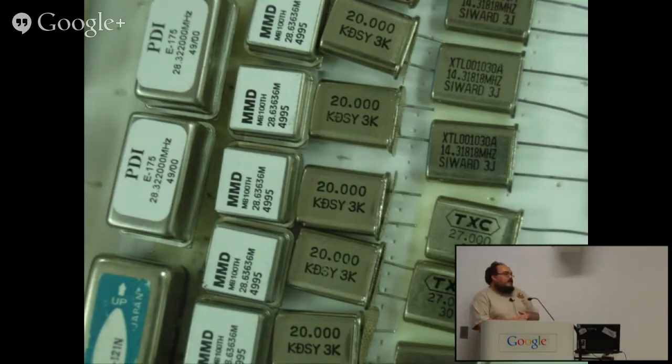So yeah, the next step to make these oscillators more accurate is to first add a temperature sensor, and by using previous measurements, compensate for the drift of the oscillator from temperature by what we think is happening. The next step above that is adding an oven and keeping it at a solid temperature, so you get more consistency. There's also voltage control, where you control the supply voltages, again in an aim to be more consistent to what you give the oscillator to compensate for its own drift.